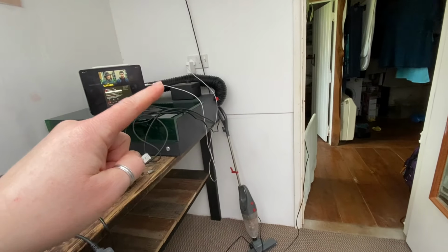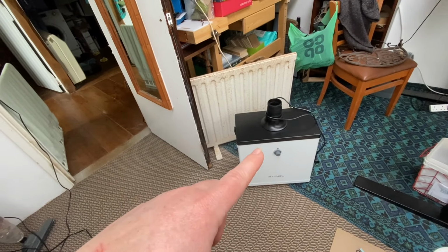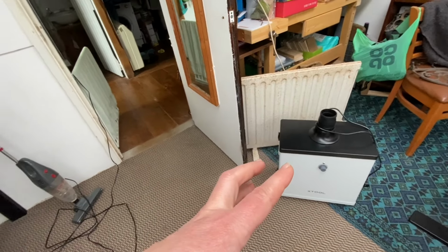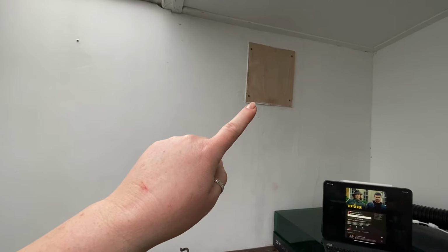So I can vent from that pipe through this thing, which will clean the smoke out. There's a big filter in there and it will trap all the particles. But then that's got a pipe, which I'm now thinking needs to go straight out of there as well. Because apparently the concern is if the filter blocks up and you're not aware of it, or you don't change it in time, or you don't have a spare filter and you've just got a lot of jobs to run, then the machine can still leak out toxic smoke, depending what you're burning.